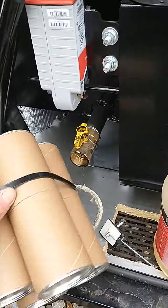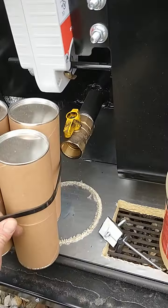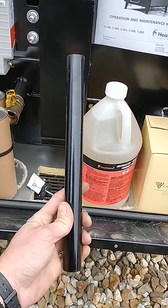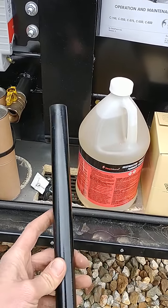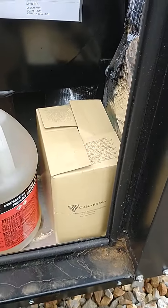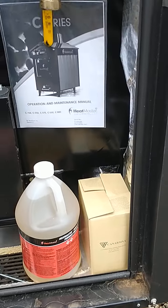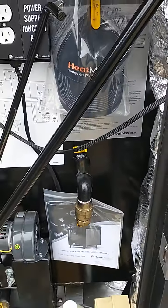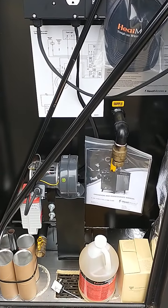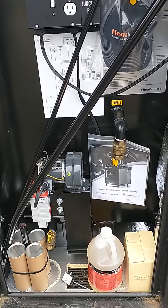The round end is nice for getting around the curves of the firebox. It comes with test bottles and water treatment. It also has an extension that goes on the shaker that comes with the furnace. There's a cover for the light — a little glass globe that goes on the front. The C-Series still has a light on the front, although they also include a headlamp. You get your owner's manual, hat, and headlamp. This one does not have a mixing pump — the C-Series don't need as much flow, so they rely on the flow of the pump to the house to mix the tank, and that's plenty.